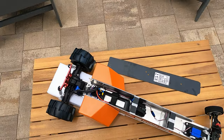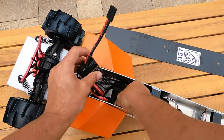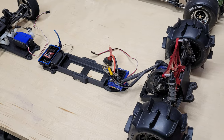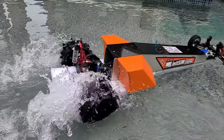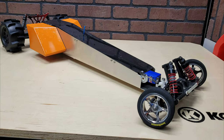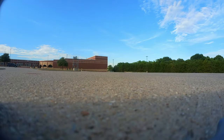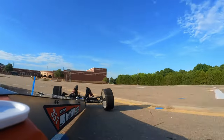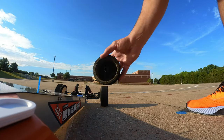If we look into this design a little more, you can see that I pretty much reused the entirety of the rear end of a Traxxas Slash. All I did was design some new 3D printed mounts so that I could flip some stuff around, make it mid-motor, and then mount it into whatever chassis design I want. I did pretty much the same thing on the front, reusing the servo as well as the front control arms. This allows me to create a modular design that I can make tons of different car styles with, and I hope to use this in the future on some of my other random builds that may look totally different than this.